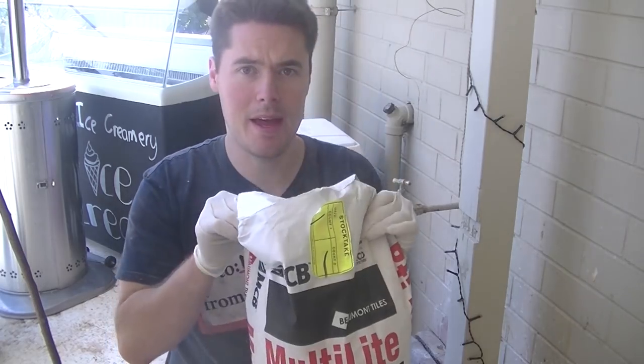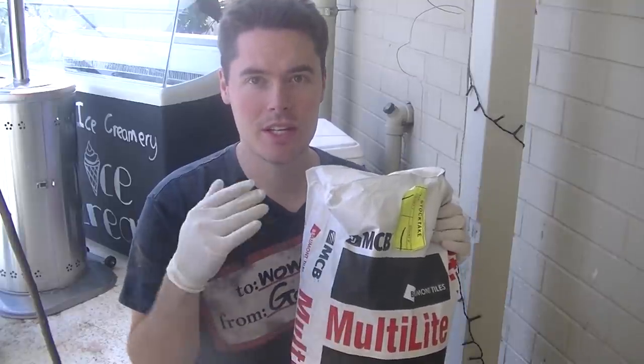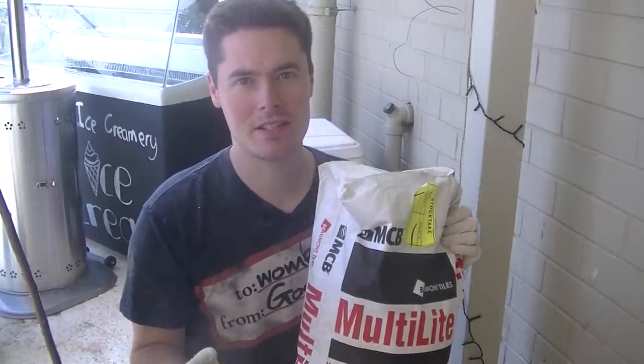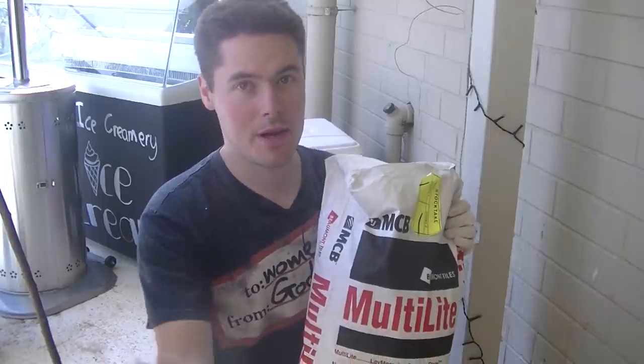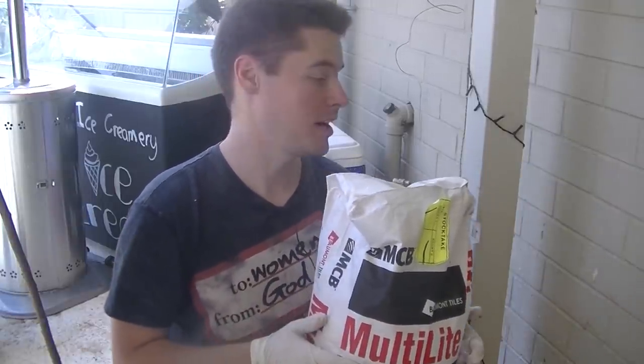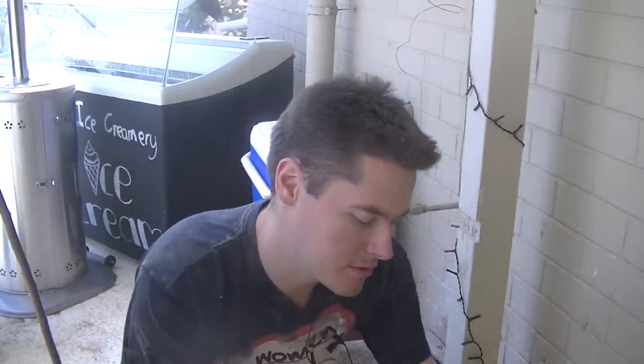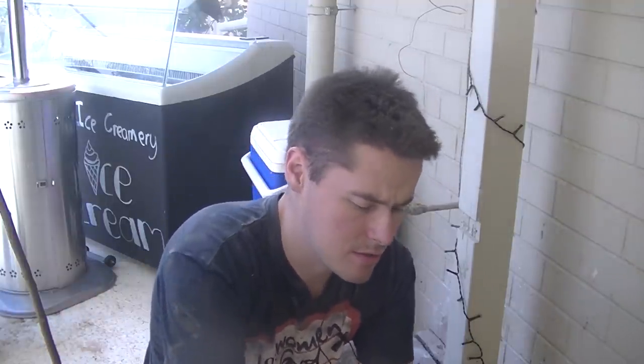I have a big bag of powder, and basically I mix it with water. You want to get it to about the same consistency as toothpaste, and then it's just a matter of spreading it on and putting it down. It's not really more complicated than that. So I will mix this lot up and show you guys how it's done. So only mix up the amount that you can use in about half an hour. Any more than that and it will start to cure, and it's just no good for it. So we'll start going.